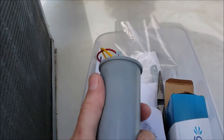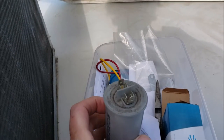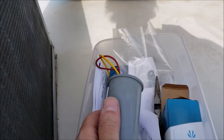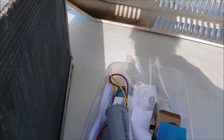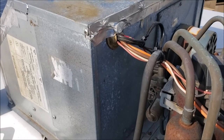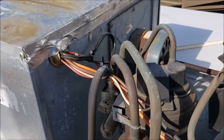I'll test all my old capacitors and whichever ones are closest to spec I'll keep in the RV as spares while we travel — just in case I lose another one in the middle of Death Valley someday. If your air conditioner craps out on you, be ready: keep spare capacitors on hand or go ahead and change them out preventively. Get the service manual for your particular model, watch a few YouTube videos, and you'll be ready to go. Thanks for watching — have a blessed day!